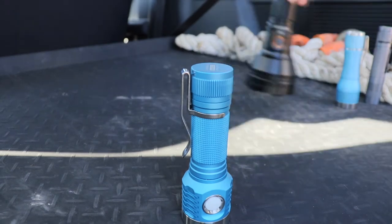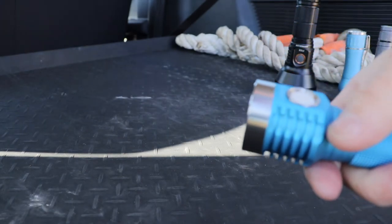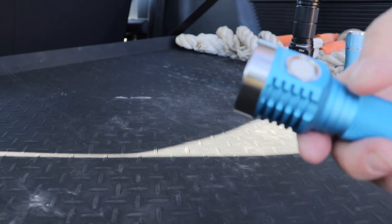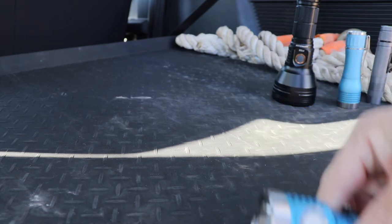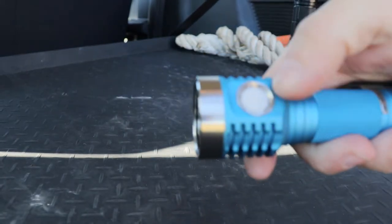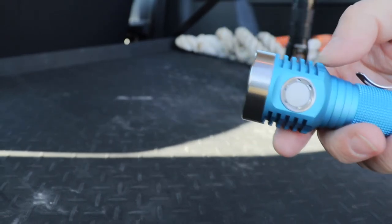What I would say is this does get very, very hot. The turbo mode literally ramps down as soon as you activate it, and after 30 seconds it's only a couple of hundred lumens - going from 4,000. It does get quite toasty, so that peak figure is a bit of a show-off figure. Whereas something bigger like the FT03, while it's still going to sag, it's got a lot more mass so it can sustain a high output. Even on non-turbo, just on normal high, this will get quite warm quite quickly and will start to dip.